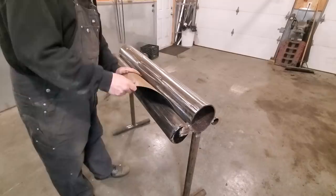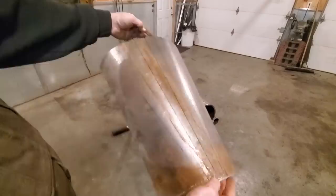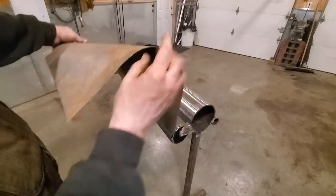This is always something that was never very easy to do. I had to do it on the bench with a piece of pipe clamped on the bench. So you got a cone shape, smaller on this end, bigger on this end, right? That's the way you make a transmission tunnel. Nice smooth contour all the way along it, right? Soft roll bends.